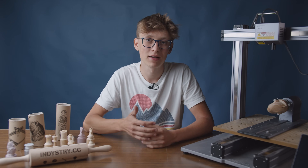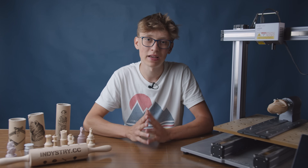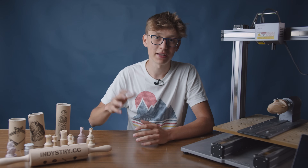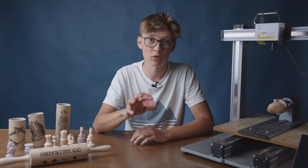When it comes to different materials like glass or acrylic, unfortunately it is not possible to engrave on those. Maybe with anodized aluminum it should be possible — if you have a water bottle made out of anodized aluminum, engraving with this laser should work, but I haven't tried that so I'm not 100% sure.